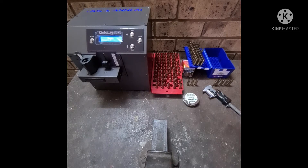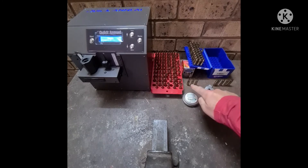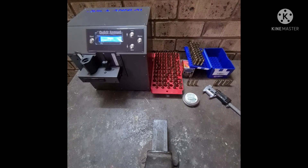After three days, we'll come back and check if they're still at two thousandths. If they go back to one and a half or one thousandths, that is actually bad for your groups and your accuracy. We would like that two thou to stay that way. If it creeps back, maybe it's not annealed optimally, or it's part of the brass manufacture. We don't want it to go back because creep will influence our accuracy and the tight groups we all strive for.